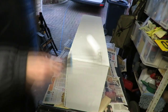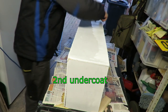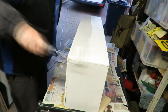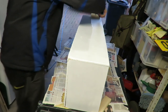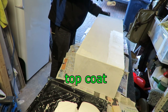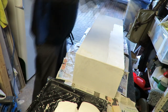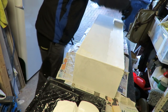Give that about an hour to dry and then give it another coat. This coat should cover it completely — you shouldn't be able to see any wood coming through. If you can see it at the end, just give it another coat of undercoat. I like to do two to three undercoats before I do a top coat when I do woodwork at home. The undercoat is just normal household undercoat, nothing special.